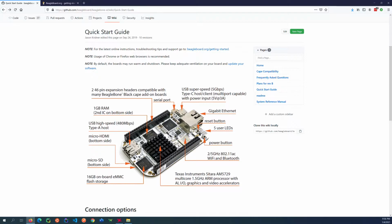I would say first off, I've already powered this on before, and it gets really hot. Like really hot. In fact, it got so hot it thermally shut me down when I was initially looking at it. The command line said that it got to 95 degrees Celsius. I put a temperature sensor on the heat sink over the processor, and it got up to like 165 degrees Fahrenheit, and that's just the heat sink. So it can definitely burn you. I think I'll need to put a fan on here for sure, just to run it normally.